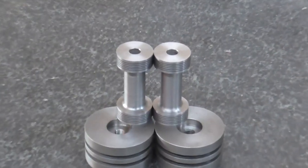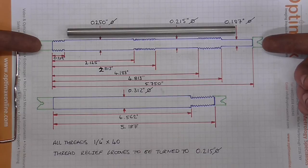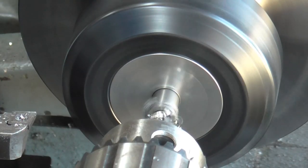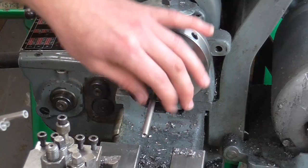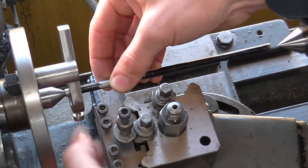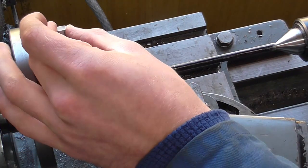There I have two finished bobbins and two semi-finished pistons. On to the rods — I require two of each design. These are in stainless steel and the first process is to centre drill the end of each rod, so eight centre drilling operations. That gives me four rods in stainless steel ready to proceed, and these are being machined using the traditional between-centres setup with drive dog arrangement.